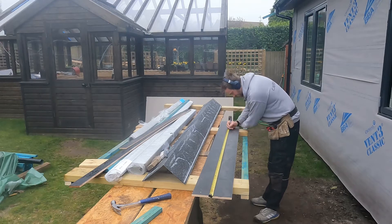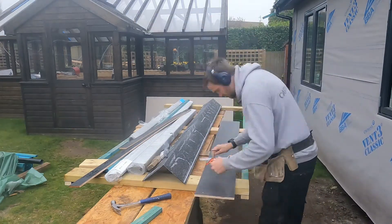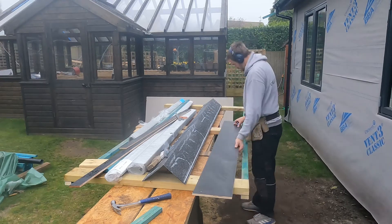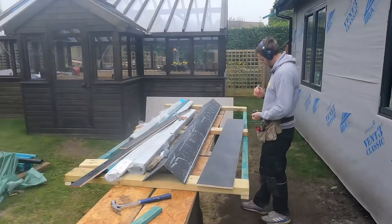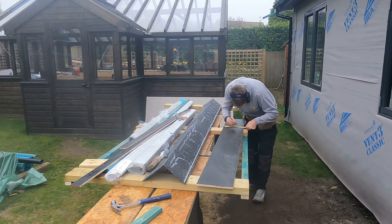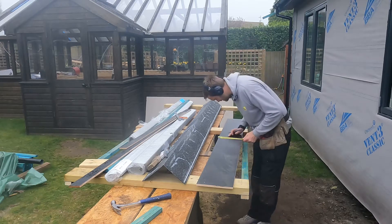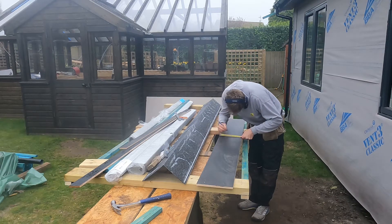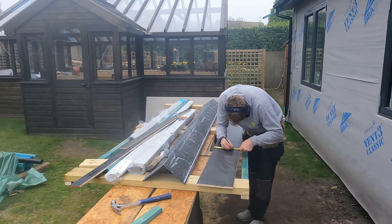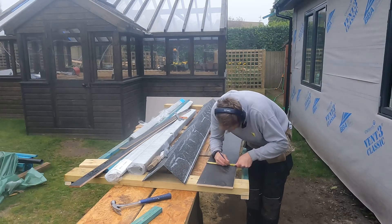We can't get to two metres because that's sitting right down at the pinnacle point between the fascia and the soffit. I came in 50mm from both ends, so because it's roughly 230mm board, it's 50 and 180 — and that gives the same distance on both sides, give or take a millimetre or two either side. So when you look up underneath the soffit, it's lovely and parallel all the way up through the run of your boards.